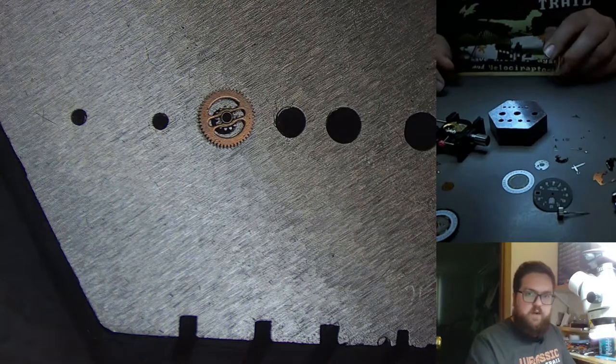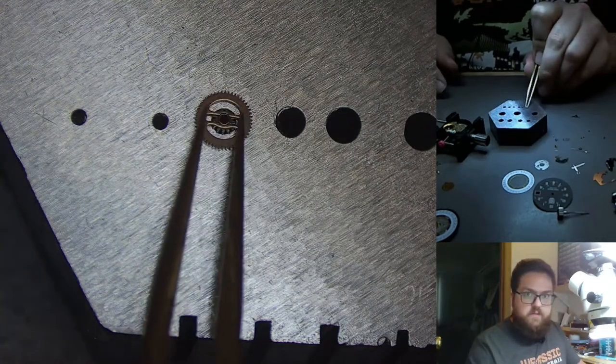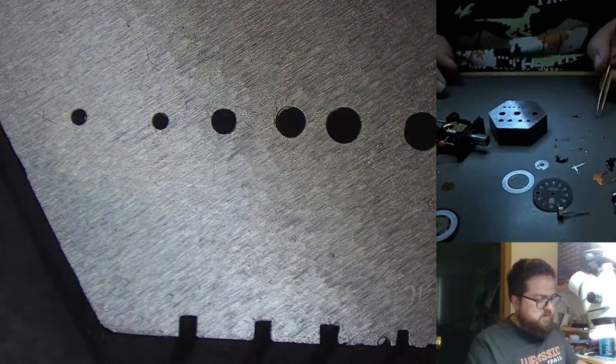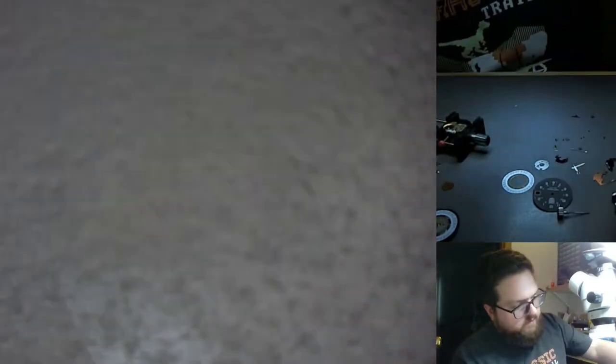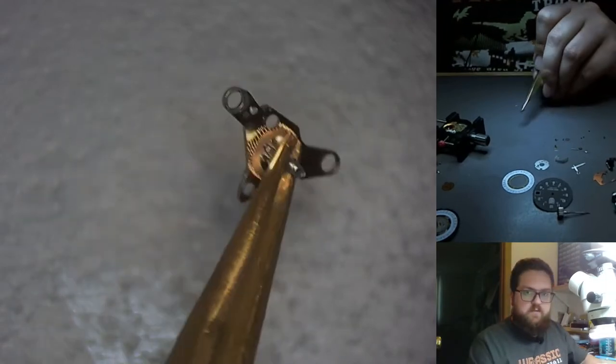Well, these blocks are really nice because I can just hold that for me and then just snap it into place. Now, why couldn't I do that the other way? Because I was pushing on the copper ring instead of on the cannon pinion there. Since I've got this open, I might as well put a little bit of the juice in there, a little bit of the sauce. Just a little bit. There we go. Also helps me pick everything up together.